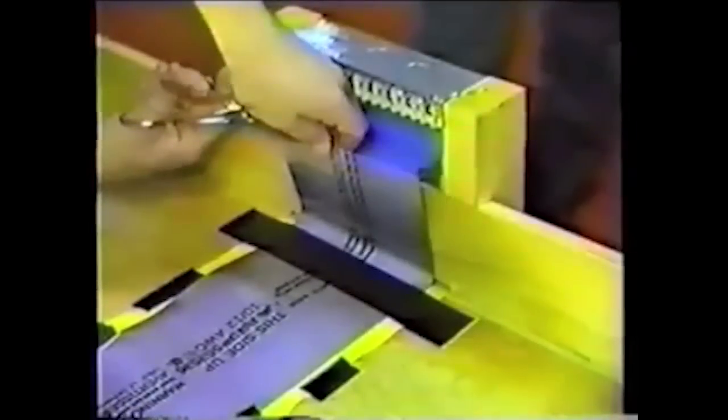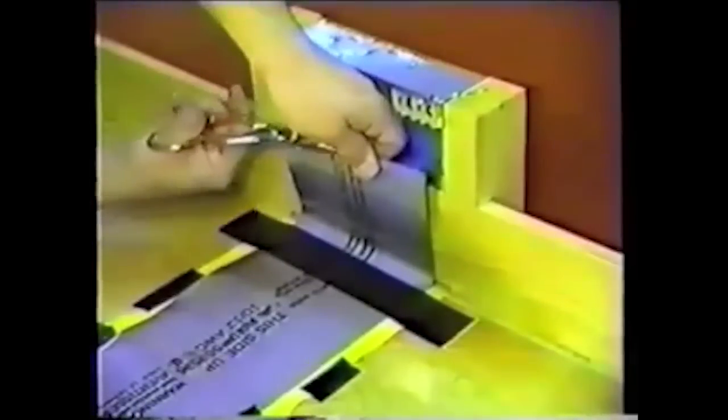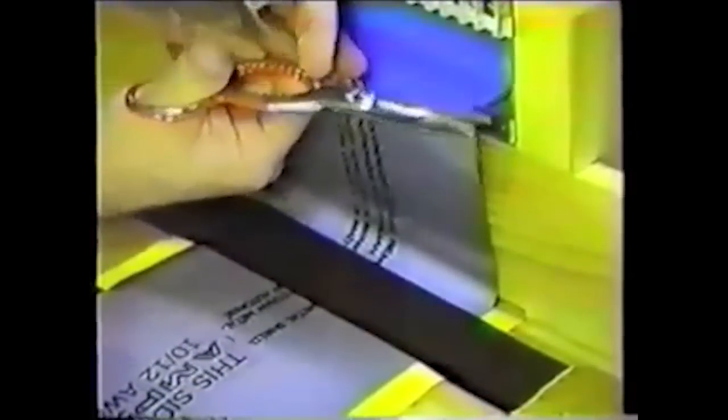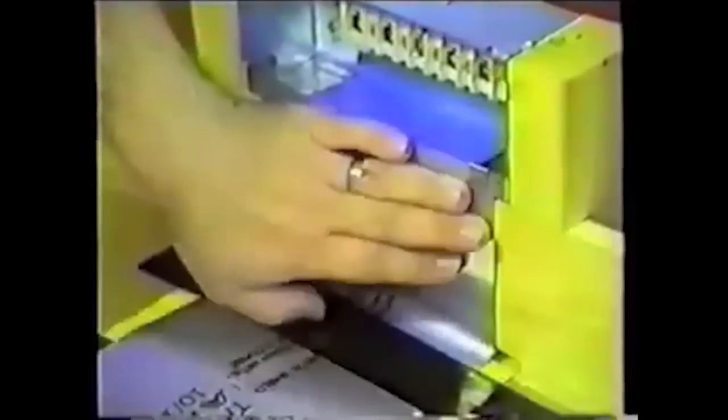Using sharp cutting shears, cut the top shield off even with the top of the box cover mounting ears located on the lower front of the box. Attach the top shield to the box cover mounting ears with 2 stainless steel bonding clips or 2 8-32 machine screws.